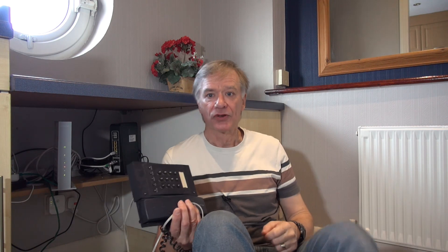VoIP connects a telephone straight into your internet router. On the back of the router there are two telephone ports, and the company — in my case Virgin Media — provides a little adapter. That gives me one telephone point, but it's not much good because I want my telephone in the lounge and in the bedroom, so I've got telephone points all around the house. What I'm going to show you today is how to connect this adapter back into those telephone points.